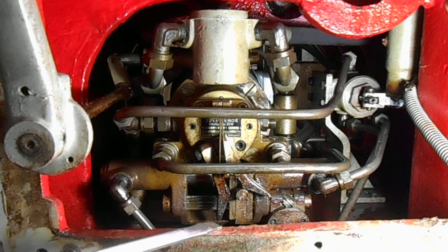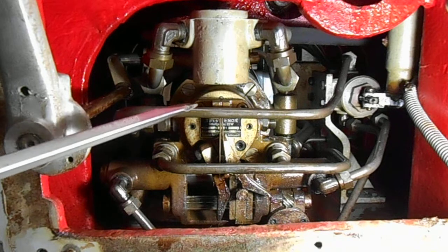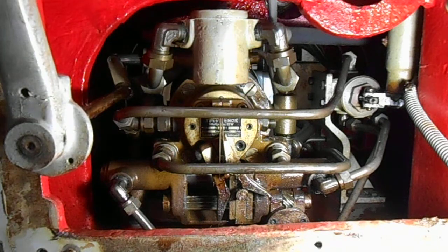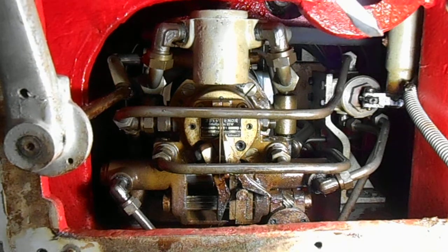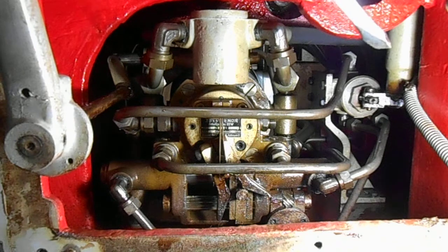What I don't understand is that the system seems to be sealed, and once it's full of oil, it's not changing the oil. There is another line that connects into the top of the pump here, which I would assume is another overload valve. There doesn't seem to be any adjustment on that, and it doesn't seem to be letting any oil out in normal use. I'm wondering if it should be letting oil out in normal use as the pump gets loaded up at the end of each stroke.